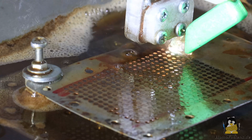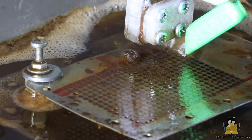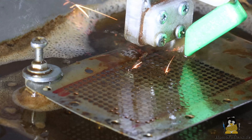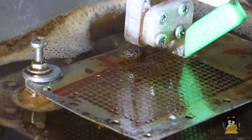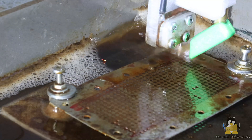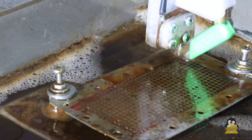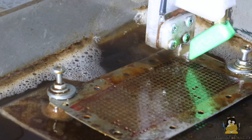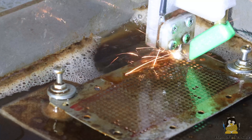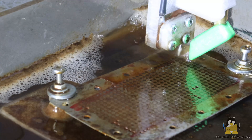The increasing conductivity of the water is no problem for the electronics of the welding inverter — sparks continue to be reliably generated. This is often not the case with more sensitive power supplies designed specifically for EDM. However, the flow of ions dissolved in the water causes electrochemical removal of material from the workpiece, which is undesirable. If you know what is good enough for your purpose, the design can be simplified and made cheaper.